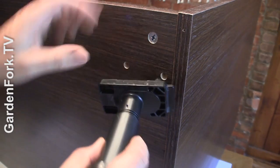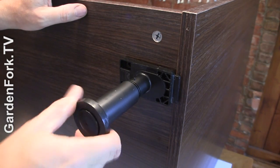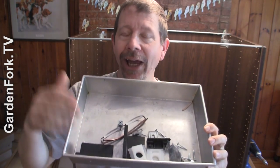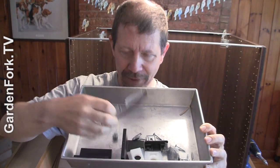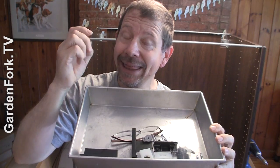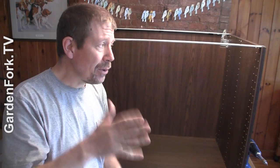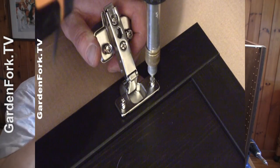We have succeeded in building the box itself. You're going to put some little plastic feet on, then lift the cabinet onto the feet — don't tilt the cabinet because the feet will break. You may or may not have some leftover parts, and that's okay depending on how you're affixing the cabinet to a wall or other cabinets. If you have any round locking nuts left over, that might be a red flag to check where you may have missed putting one in. We also have a video about putting together an IKEA wardrobe that covers how to put on doors with hinges. On this cabinet, I'm going to put drawers.